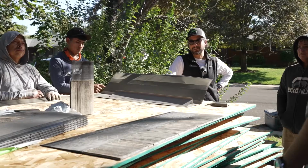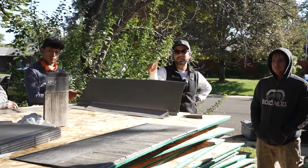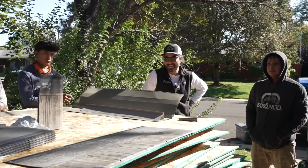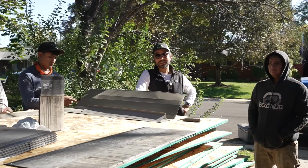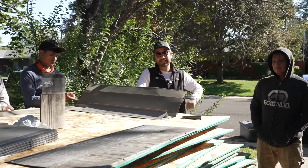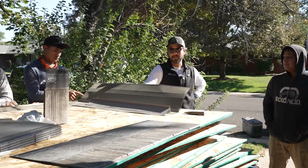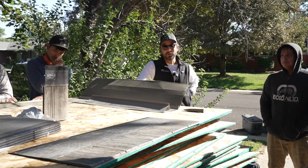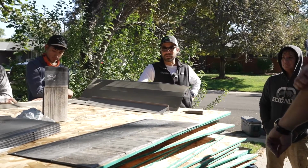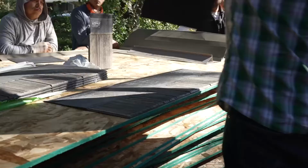The customer actually was joking, thank God he was joking, but he said, "Is it called F-wave because my roof looks wavy now?" I said no, but we did have to go back and replace probably three squares of decking. That was a pain. So now I really warn them: you should do a redeck if you're going to do this roof, or be aware that you'll see some transference, and if you're not comfortable with that, you should think about a redeck.